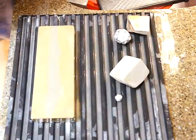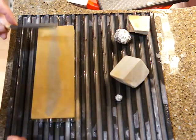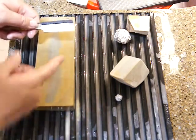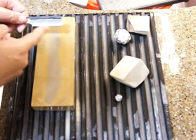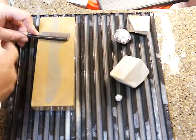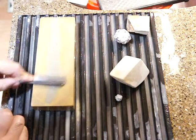And make sure we don't contaminate it with dust or bigger particles, then wash well. The razor has to have the shinogi line and the edge line straight, and then attach it on the whetstone, from the heel side to the tip side, both sides, otherwise it doesn't work for sharpening.